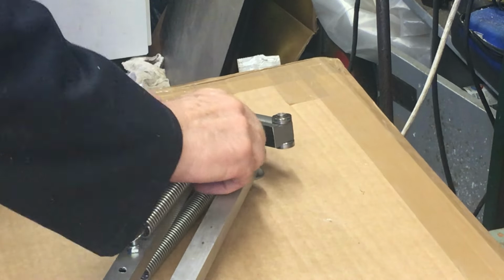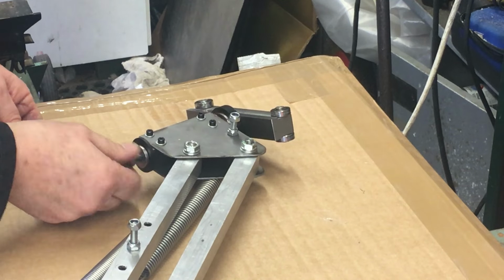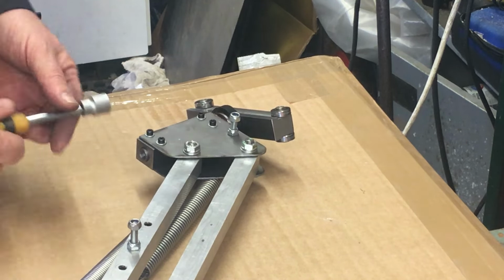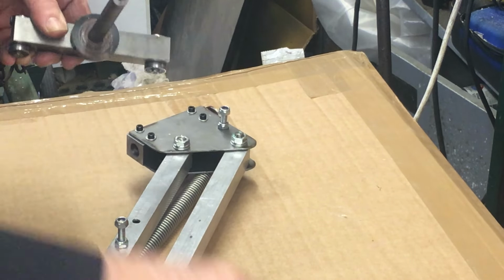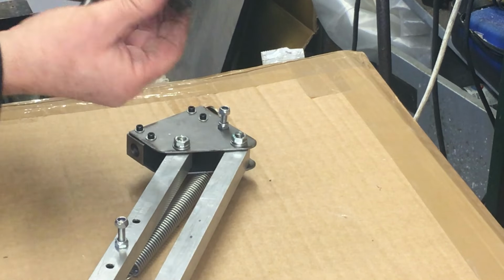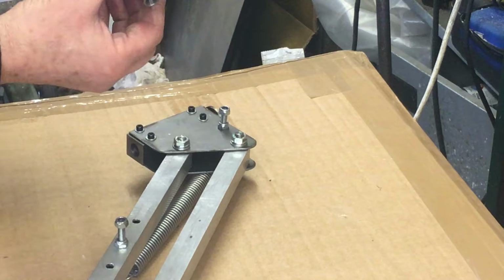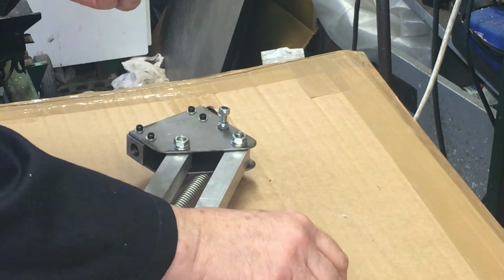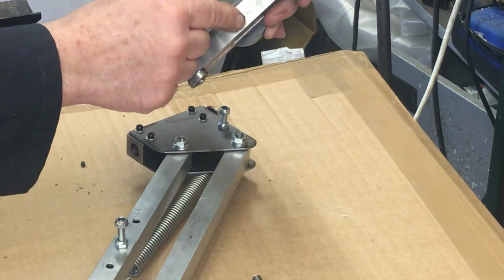Okay, this is the far end. I'll just take these springs off of that one just to get it out of the way. All that is a short another Delrin washer, and this then just comes straight out the top. There's another Delrin washer here, but it's actually been machined with a step in it so that it goes over the top of there and clamps onto the bottom of the rail. So once that's on, that goes on there, and that's it. It's internally threaded 8mm, externally threaded 12mm at the top, and screws into the base of that.